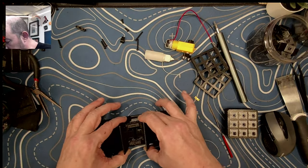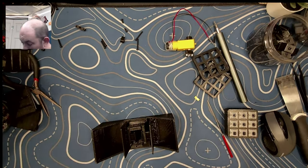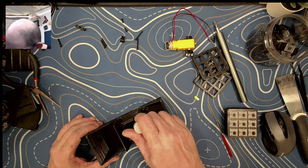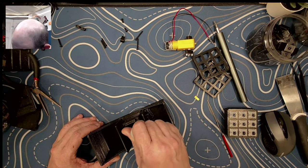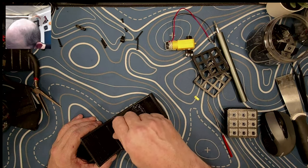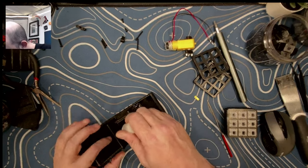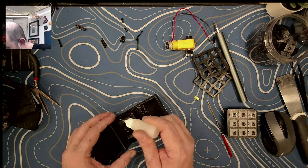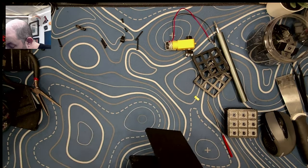And as you can see, they slide back and forth. Now I like to grease these as well, but I do like to do it once I've put it in. First time I did it beforehand, I got really greasy. We're not looking to put too much. We're just basically looking to get these arms that are going to be going back and forth inside to have plenty of lubrication, both on the top and the bottom. Usually you can just push it in, give it a good squirt, and pull it out and catch any it might have missed.